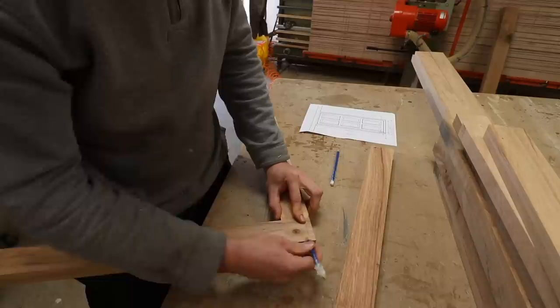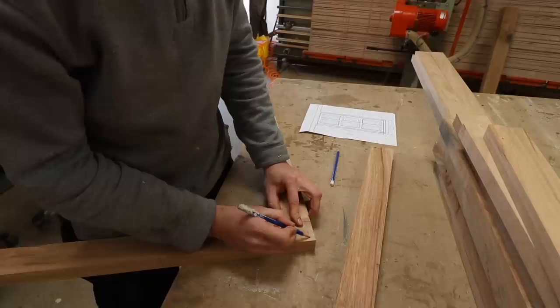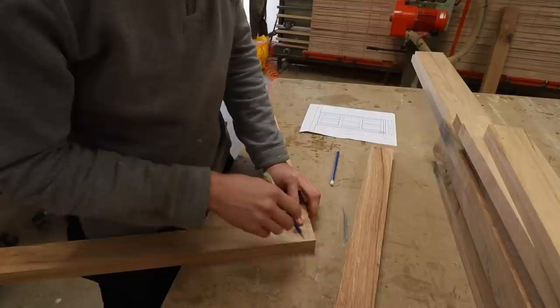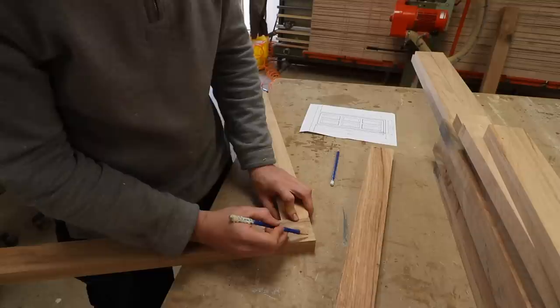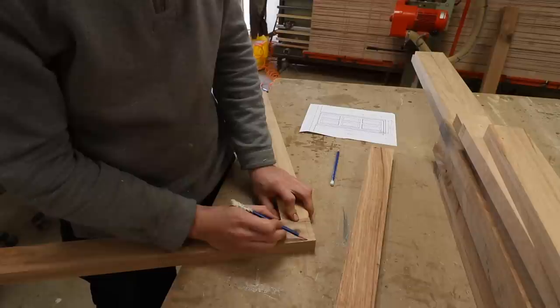So we're going to have a bit of fun. I've got to mould this in afterwards and stop it short of the corner here. And the same across this end grain, got to mould it into that and then hand finish this corner here into a mitered bead shape. So that's going to be quite interesting. I can't quite see, because all the ends, the grain's broken off on the existing one, whether they've just run the moulding through from both directions and had just a little bump in the corner, or whether it's been made to look like a mitre. So I'm going to do it like a mitre and try and hand chisel and carve that piece in, but it's going to be a bit interesting with the end grain as well.